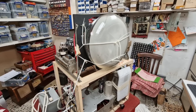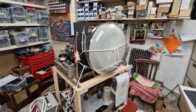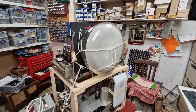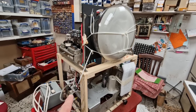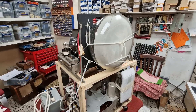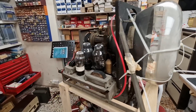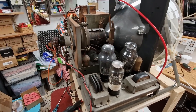The CRT has been replaced. This is a 1949 Ferranti tube, and it only needs 5 kV for the final anode. This machine generates about 4,849 volts, so we're very close to where it needs to be for this tube. As I take you around the side here, you can see it's a beautiful thing from the 30s.